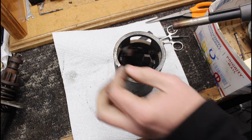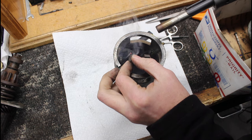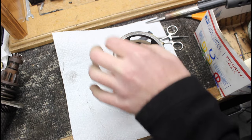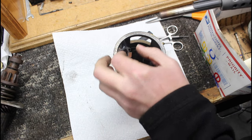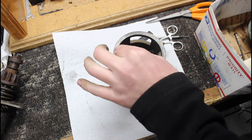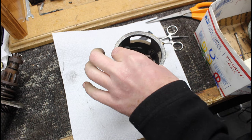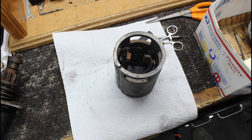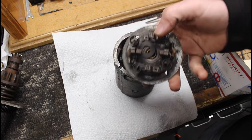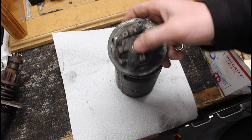All right, I'll torch it here. Ooh. Guess that old cloth burns a little. All right. There we go, that should cover it up pretty good. I put a little bit of tape right at the end there, but I'll clean this up. And then the trick is, you gotta get the brushes back in these holders here when you put it in there. These other brushes look okay. I'm gonna clean this piece up a little bit and then we'll get it all back together.